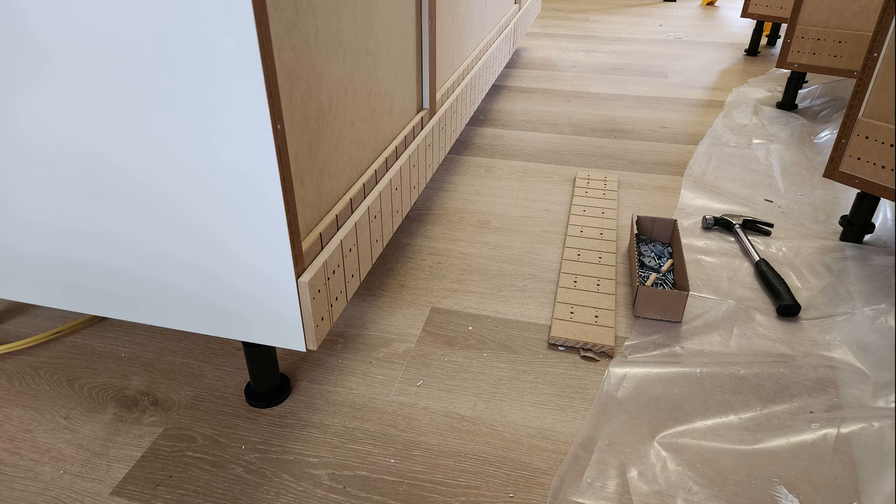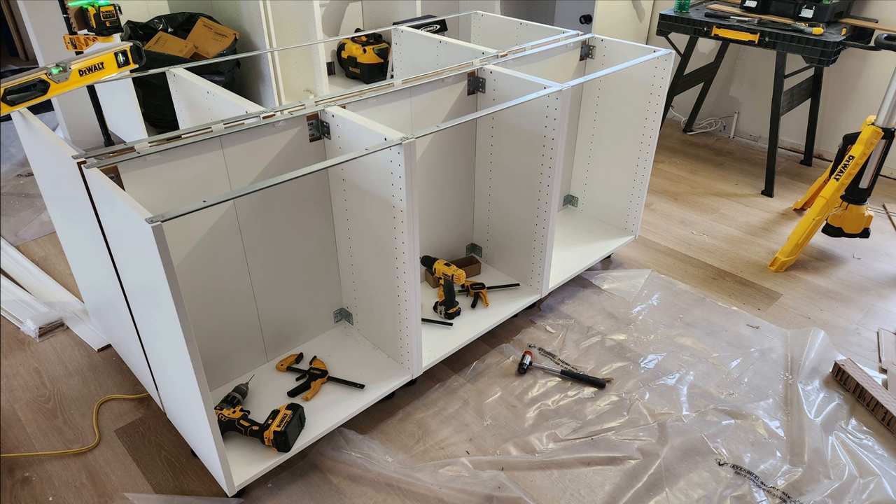In the picture you see I have put up one layer, but I need two layers — because we have two cabinets sitting back-to-back and at the top we have two strips protruding, so that is two layers, and I have to do the same at the bottom. It's much easier to put those two layers on the same row already installed rather than trying to put them on the second row, because then you have to do them cabinet by cabinet as you cannot lift the full row in place. So put two layers of that strip material on the back of that row of cabinets, and when those strips are mounted you can place the second row up against the installed row and tie those cabinets together with each other — not to the other row just yet, just tie that second row together.